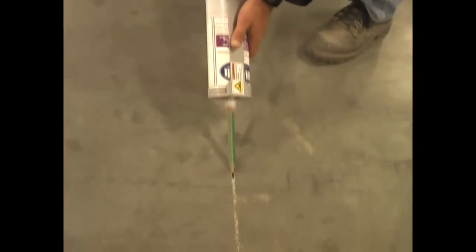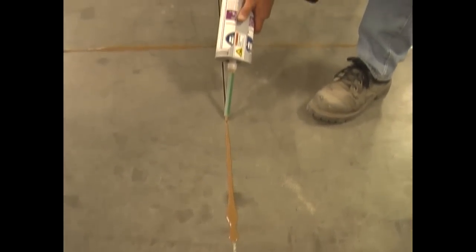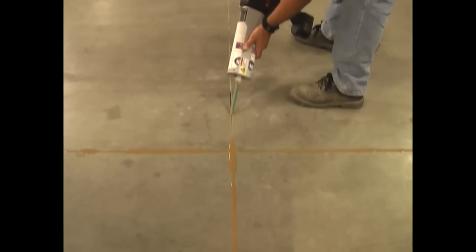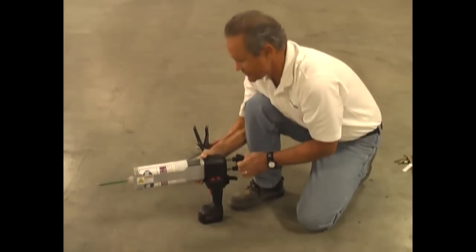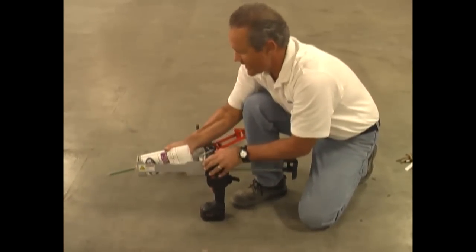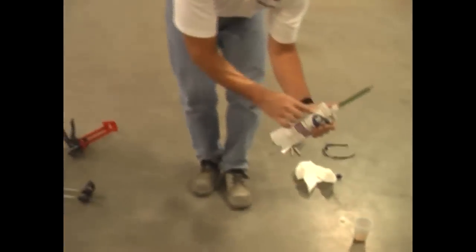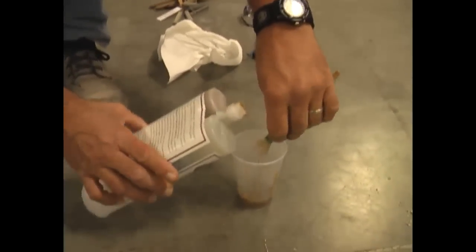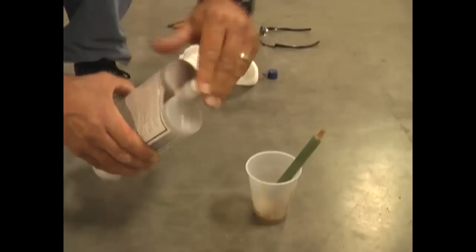Going back to this joint right here — we've gone ahead and filled the amount of joint we are doing out here on this job. I'm going to take the cartridge out of the dispenser and lay that to the side. I have a little bit of product left over, so there's no reason to waste it. Simply undo the mixing nozzle, point it down so it doesn't contaminate that side, then just reinstall your plug at the top.